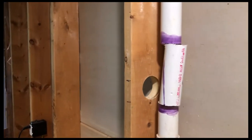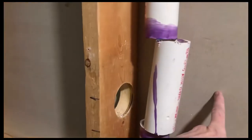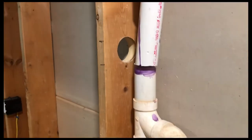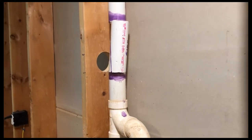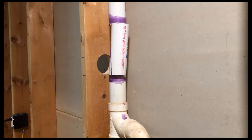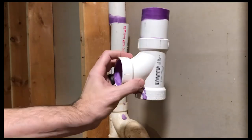Now I'm going to add the vent for the sink - going over this wall. I already cut this pipe. It took me a minute - I didn't have a saw that would really work well because it's so close to the drywall and so close to the stud. So I had to use my coping saw again. But now I'm just going to put the piece in there. I've already got these two ends primered and primer on my sanitary tee. It'll be turning this direction.